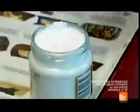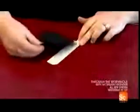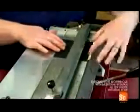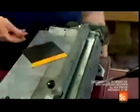The next worker applies a water-based adhesive to a leather strip. It will reinforce the top of a fabric square. With this manual device, she turns the top edge to fold it in a straight line. This leather-trimmed fabric square will be used to create a credit card pocket. She stamps a thin groove onto the leather trim to give it some definition.